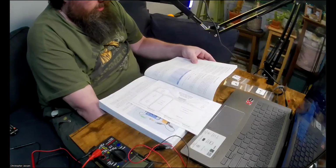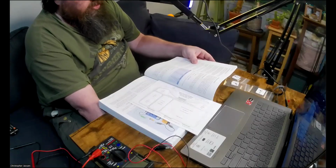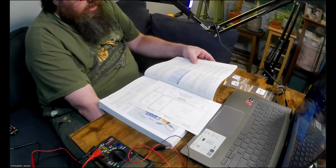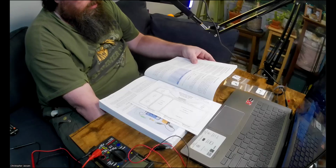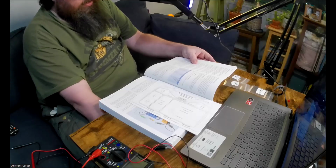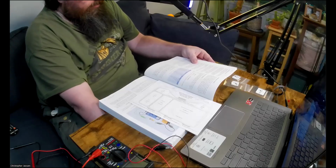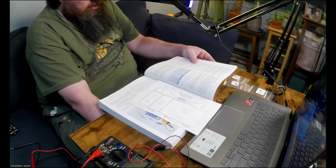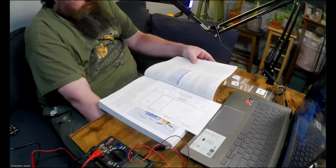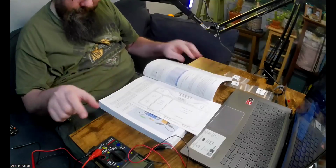Measuring current. Every meter I have ever seen has a socket for measuring current labeled either 10A or 20A, telling you the maximum number of amps that it can deal with. You won't be measuring a high current like that right now. Your meter will also have a socket labeled in milliamps for measuring smaller currents. The maximum for this socket is usually printed beside it. Often it's 200 milliamps, but sometimes it's 400 milliamps. Look carefully at your meter and make a mental note of how many milliamps it will stand.